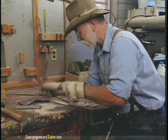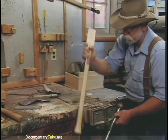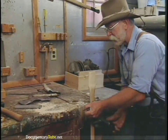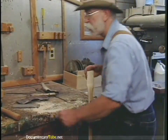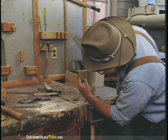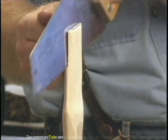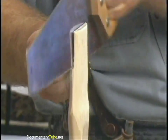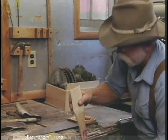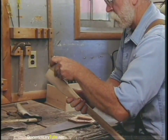I think this is going to be our last fit. So before we try it again, we're going to put the kerf to the right depth. Now's the time to do that because we probably won't have to take it out again. Get it locked in there real good, get your saw, and you can see it needs to be about two-thirds of the way of the depth of the head. Take a look at it here.